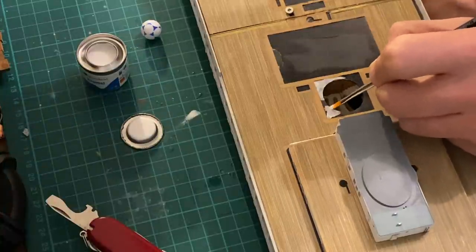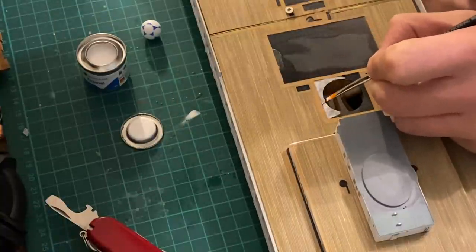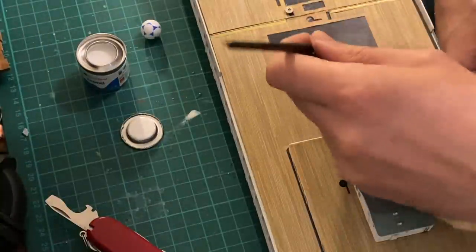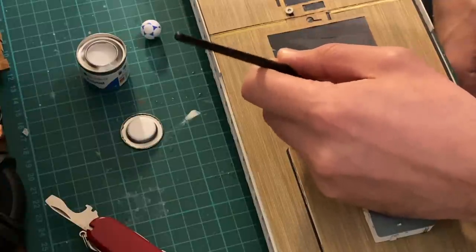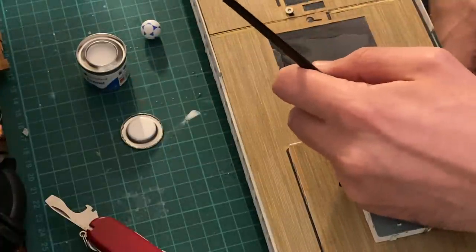and that was, you know, rolling, checking, rolling on the plastic part from the Trumpeter kit, rolling with that ball thing that I was using. So there was a lot of gradual work. And it's worth pointing out as well that halfway through I re-annealed the dome again.